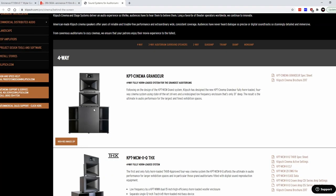The way it sits, it looks like it would be really good for a four-way system. If you take a look at Klipsch, for example, they do cinema systems with four-way setups: a really giant woofer — 18 or 15 inch — a mid-range, then a mid-high range. That's where I think this one would be really good, playing somewhere between 2,000 and 6,000 Hz, then crossing over to a final tweeter from 6,000 to 20,000 Hz.